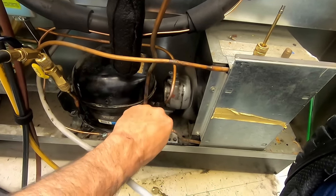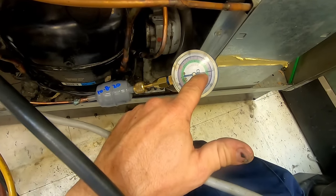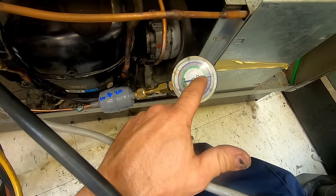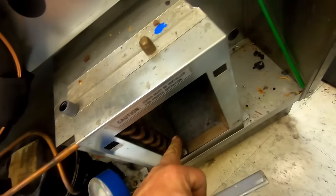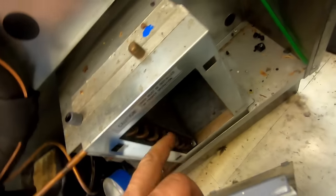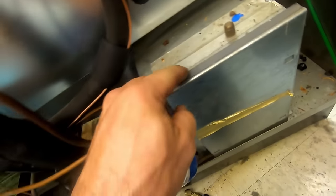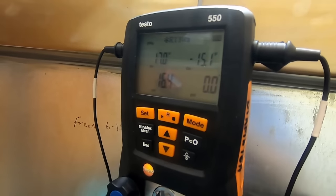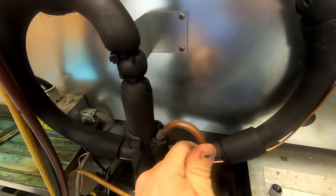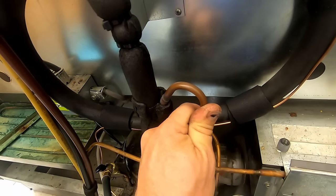It's a little bit warm. We had to take about equivalent to what the hoses would have lost. Got her down to about 155 there, which is about 113 degree condensing temperature, which there is some restrictions here because of the filter and it's pulling up from underneath the cooler, so I expect it to be just a little bit higher, but we're running a 16 degree evaporator. We're coming back cool and cold, not freezing, not flashing, anything like that.